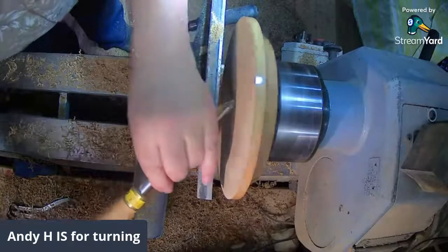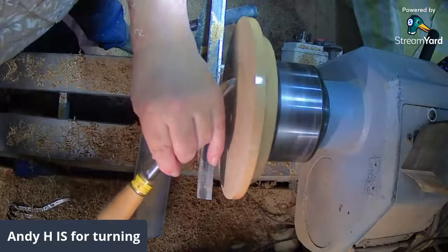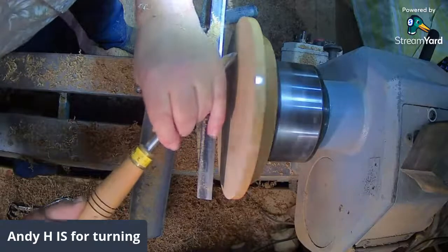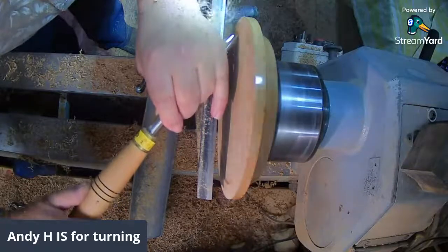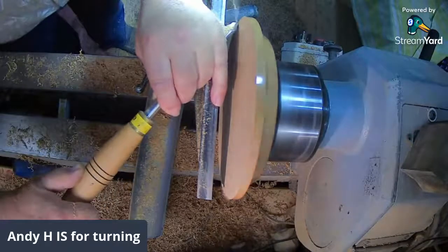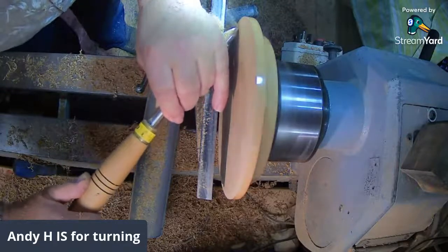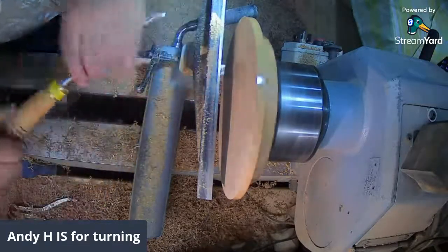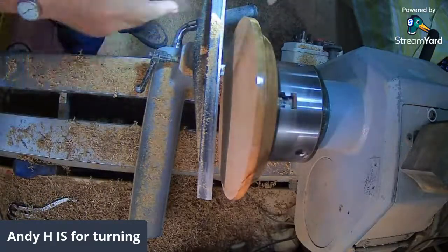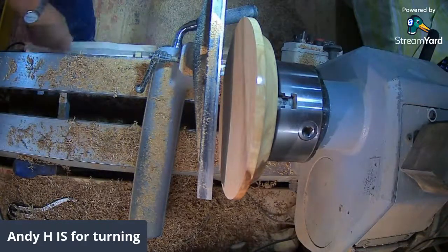It's much like the old shellac or French polishing. The shellac that they use for French polishing is quite thick, but they thin it down and put on many very thin coats. But they put that on with a rubber. I was going to say that's the other answer, is to make a pad up. So it's not something I would suggest, Eric. If you can spray it on with a can, so much better. It's hard work otherwise. Yeah.